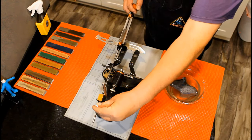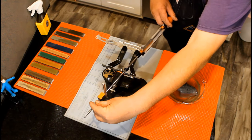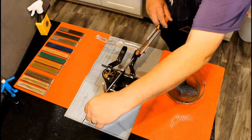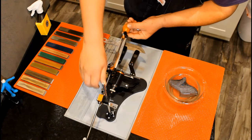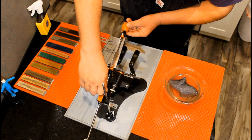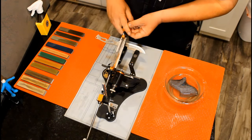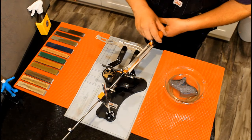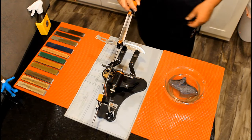Now it is time to start sharpening the blade. At this point, we need to readjust the end stoppers. From here on out, you will be using 99% cutting strokes and 1% stropping strokes. Position the stone so that you can use its entire length. Start at the base and use the cutting stroke like this. Attempt to use the entire length of your stone evenly across the entire blade. Use each stone in the same direction.